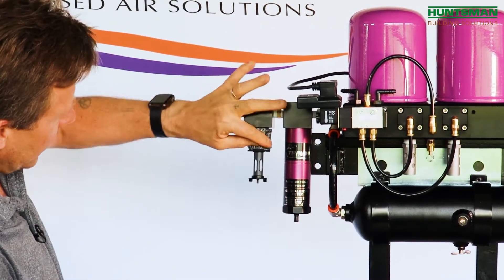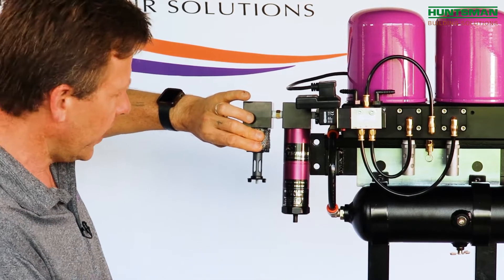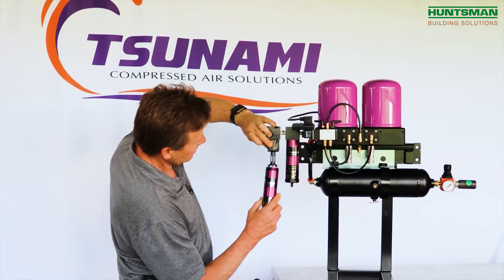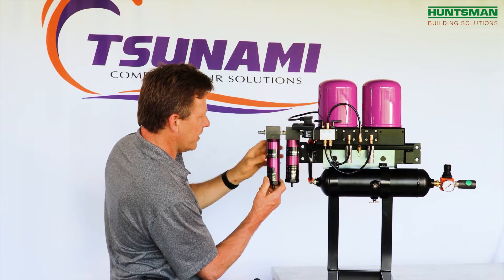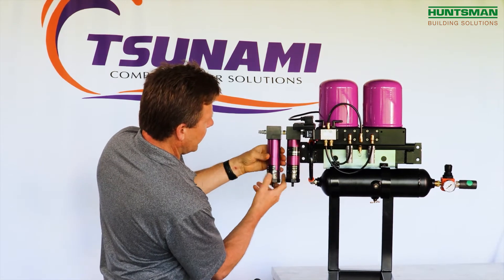You can pull this mesh out. Hold on to it a little bit as you take the tube out. Look inside the tube for big chunks of debris — things that could foul up the float drain or the pneumatic drains, which are also an option on these units. Nothing of major consequence here, so slide that up and make sure the mesh is touching the outer tube. Then screw that housing back on.